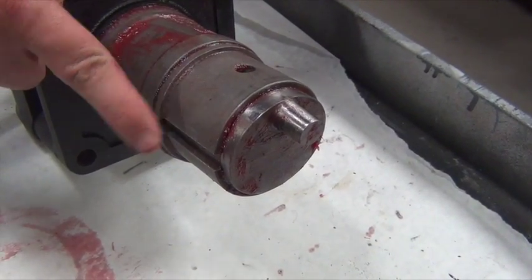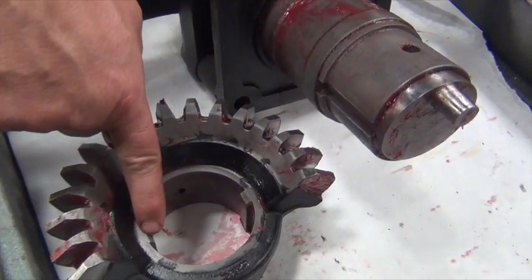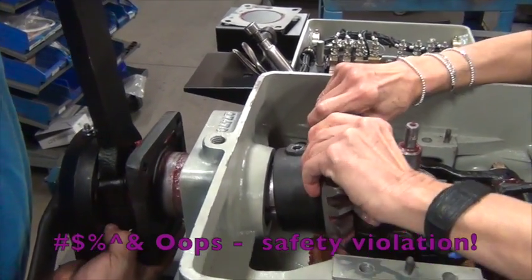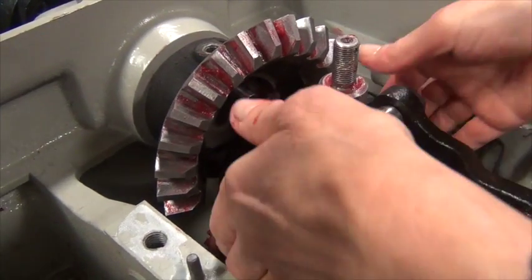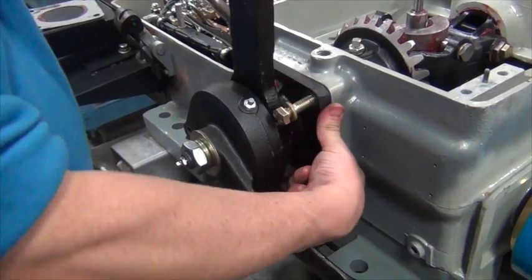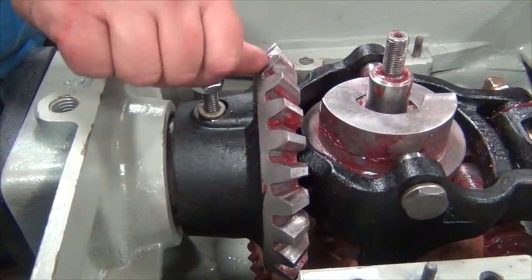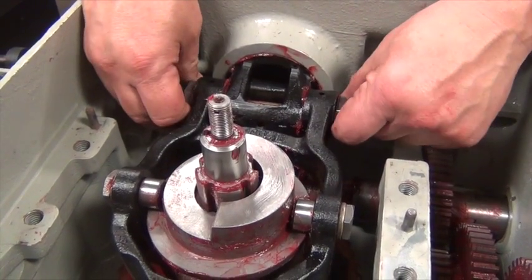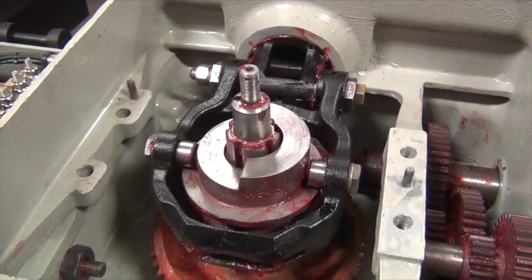When reinstalling the hand throw lever, note that there is a hole and two keyways that must engage with the hand throw gear while simultaneously installing the hand throw assembly on the side of the gearbox. With the aid of a helper, install the hand throw assembly on the opposite side of the machine. Assemble the gear so that the hole in the gear and the hole in the shaft are aligned. Engage the pin on the end of the hand throw assembly with the slot on the face of the yoke. Secure the hand throw assembly with the top two screws and lock washers. Secure the hand throw gear by reinstalling the square head screw and jam nut. Adjust the shifter — with the selector lever level to the machine, turn the eccentrics in unison until the top of the rollers just clear the top of the shifter and they turn freely. Be sure to tighten the hinge bolt.